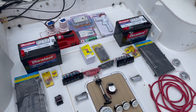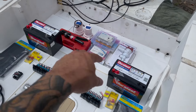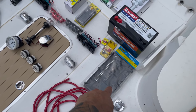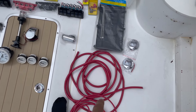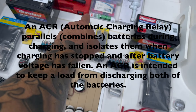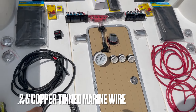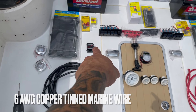I'm going to go quickly over all the things we have here. First, we have two Group 27 batteries — a deep cycle and a starting battery — one for the motor and one for the house. Then we have the battery trays, the fuse box terminals with their fuses, the wiring that goes from the battery to the ACR. The kit already shows you how to wire it. We'll run cables to the front of the boat using six-gauge wire with its 30-amp breaker.